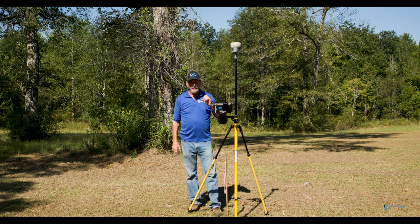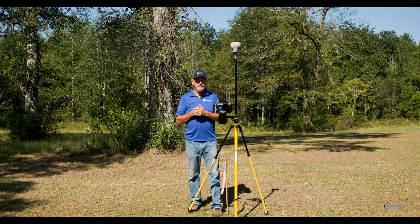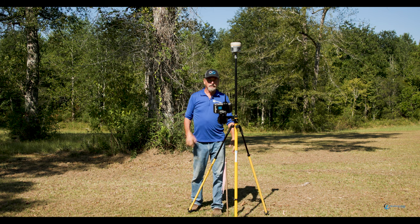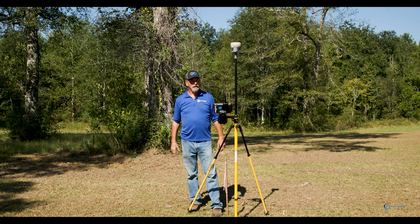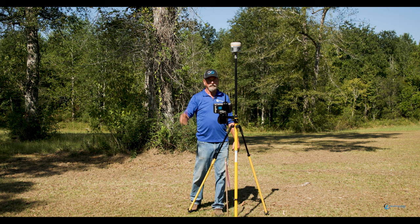We captured that site calibration by creating a template, by creating that Mississippi State Plane site. By capturing that, we're able to capture our projection, and now we can use it anytime we come out here. We can use that template for this job. So when you create a new job, you just go to that template, boom, and whatever the name of this job is, and use that. Life is good.